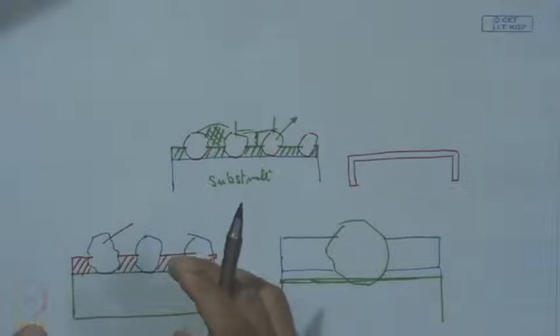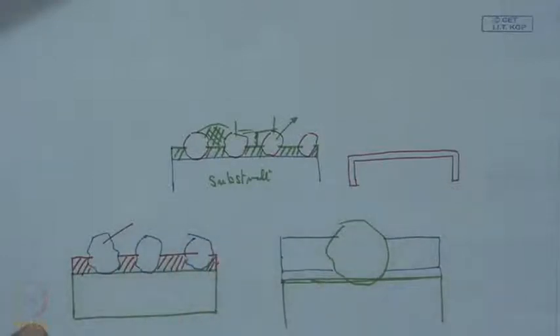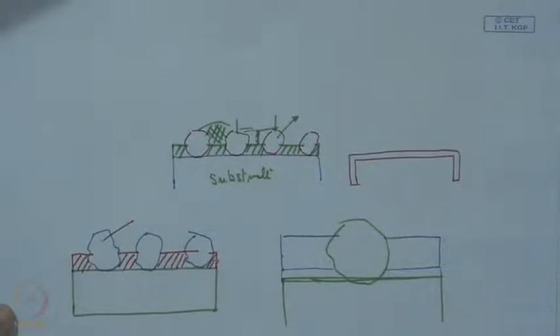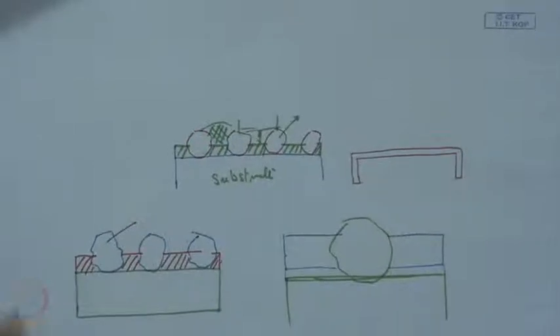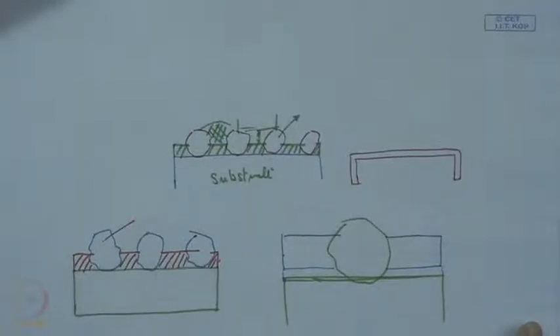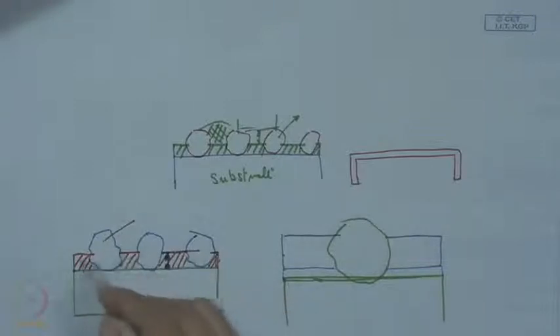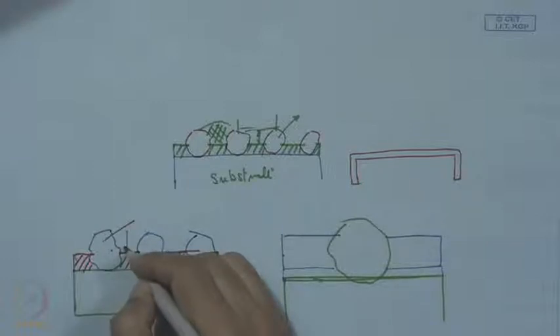The whole life of the tool also depends on the quality of the abrasive — wear resistance, retention of hardness, resistance to plastic deformation, thermal stability, and chemical stability. These will wear out with passage of time. There is a limiting bond level — a critical thickness of the bonding layer below which we cannot go. From the initial grit tip to this limiting bond level is the zone over which the grit is expected to work efficiently.